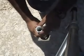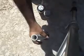Okay, here we're looking straight down into the core hole, and that's the 90 down there. We are going to reach down, primer the 90, then we're going to primer and glue the upright for the stub up, and then press it into the 90. Here's a tip. Once the glue dries, and before you hook up the product to the stub up, turn on the pool pump for a moment to clear any dirt from the stub up.